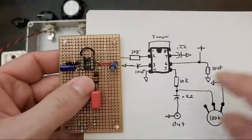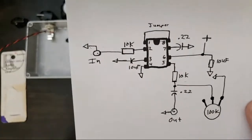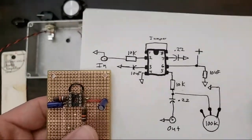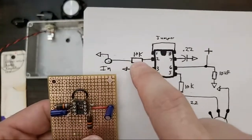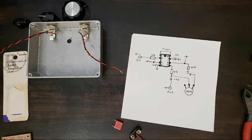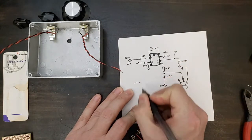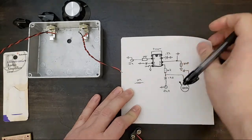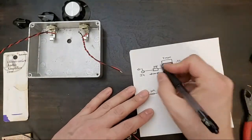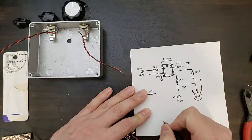Moving on, pin 7, point 22. So this is a schematic also, just so everybody knows. I tend to draw my schematics in a similar fashion to what we would also call a layout. So you see there's a 10K resistor here. That's not necessarily the symbol for a resistor. It looks like this, right? And then it would say 10K. What you see in a lot of CAD layouts now, though, is resistors looking like that. But just to clarify, I'll go like that.